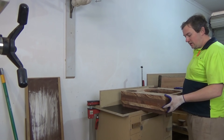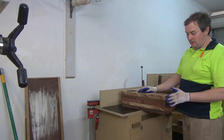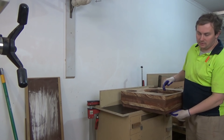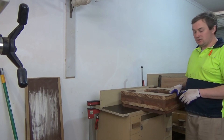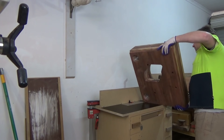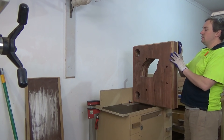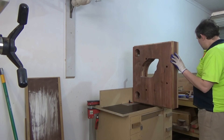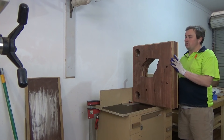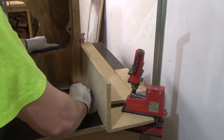I'm almost there with this big block — all I need to do is take off all the sharp corners. I'm going to put a 5/8 inch round-over on these four corners and on the top surfaces, and a 1/8 inch round-over on the extreme bottom. I'll be putting the round-overs on using my router table — stand it up on edge, put it against my fence, and push it through. To prevent blowout on the back edge, I'll use a sacrificial piece of timber behind it to give support and stop it from blowing out, giving me a nice crisp edge.